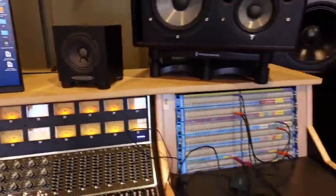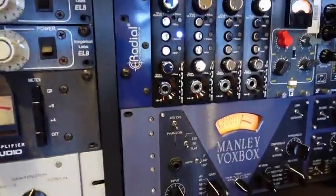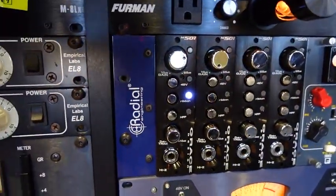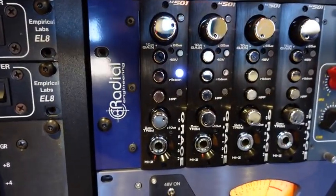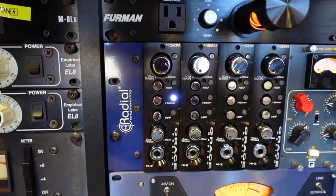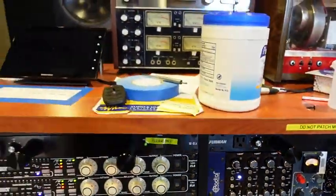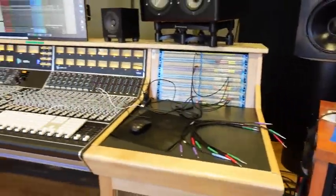And let me just show you the mic pre that we're using for that microphone. That is the Grace mic pre over here. We have our main gain, 48 volts is of course off, but this has a nice ribbon mode, which boosts the signal from the ribbon microphone without getting noisy. So I really like these pres on ribbon microphones, and that's what we're doing over here on the signal side.